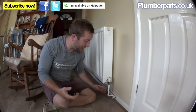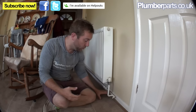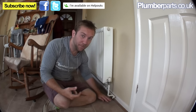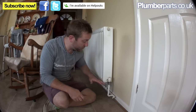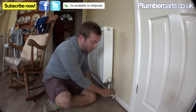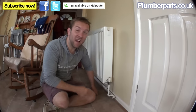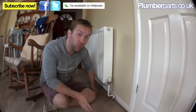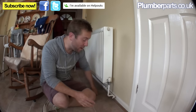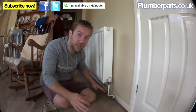Now I'm going to pop downstairs and find the lowest point that's got a drain-off on it, pop my hose on it, pop a towel on there and start draining down. I've hunted round the house and found that this drain-off here is the lowest on the system — it's on the ground floor, only about an inch off the floor and not on a drop-down leg. Make sure you trace out the pipework to confirm you're draining the whole system, as radiators fed from two pipes coming down may only drain one leg.